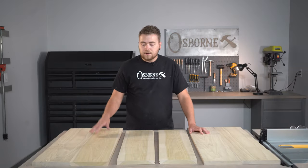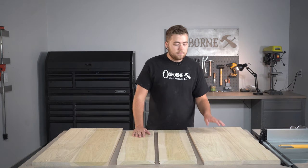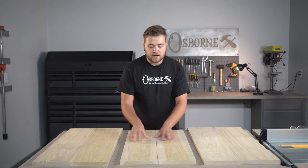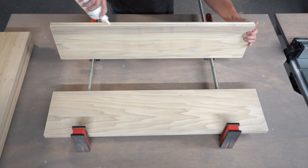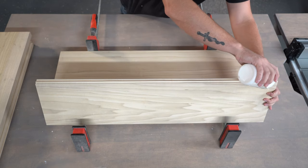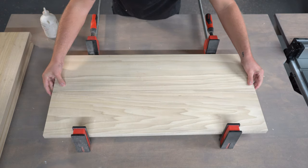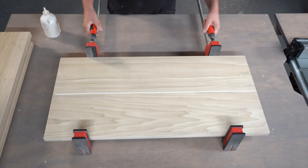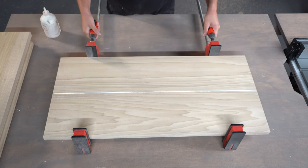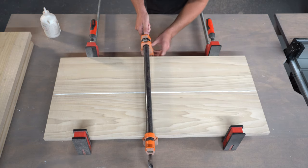So far we've got the material for our outside panels planed down and run through the router table with our reverse joint profile added. Now we're ready to glue these up. I've already picked which boards go together and matched the grain as best as possible before routing. We're going to take a bead of glue and add it into the deeper groove, then add one on the flat groove to get coverage on both edges. We're looking for good squeeze out all around, and we'll add one more clamp over the top to make sure we're not getting any bowing.